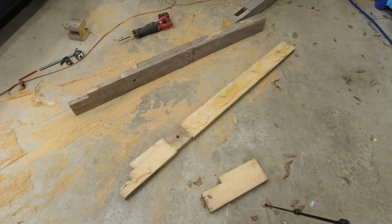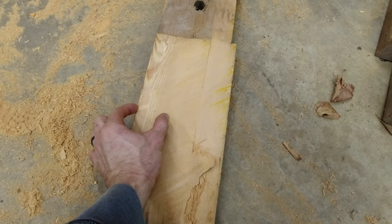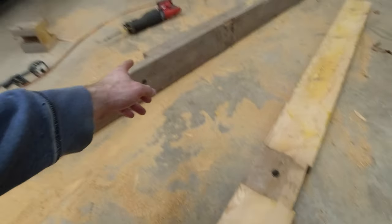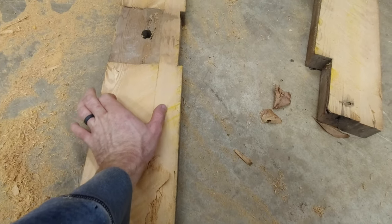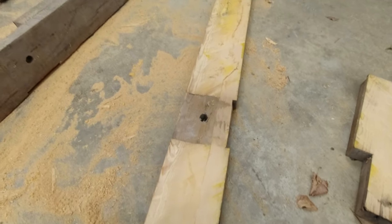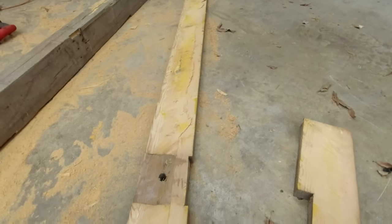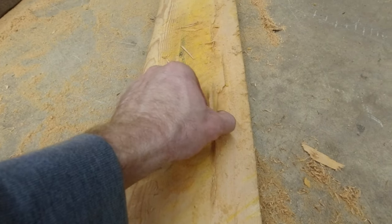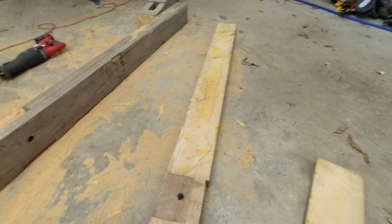This is kind of a nightmare. I was hoping that using the circular saw to cut a two-and-a-half-inch groove on each side, the reciprocating saw would be able to use those as a guide and cut the center out. But it doesn't seem to want to do that — it wants to wander everywhere and just starts gouging into the side. I don't have a saw that can cut deeper, so I'll be back when I figure something else out.